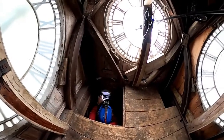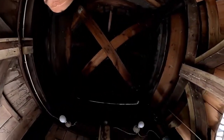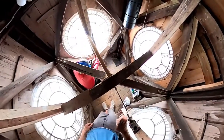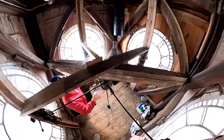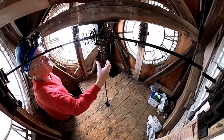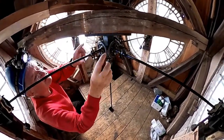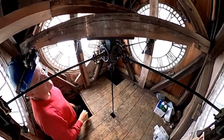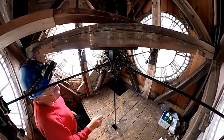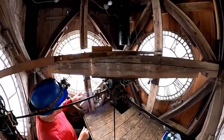Up through this hole and you're up into the very top of the clock. This is the piece that distributes the time to all four faces. This is the rod that's turned by the clock down there — that wheel there turns around and takes the time to all four faces. We had a little bit of an issue with this when we were working with it; we found some of the faces were sticking a bit, but we think we've got it to the point now where it's very happy.